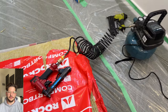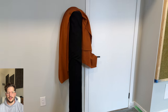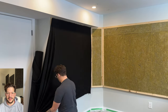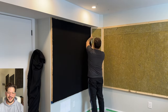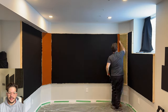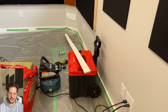Here is the stapler I'm using to staple the upholstery to the wooden frame — I'm using quarter-inch staples. The client wanted to go with an orange and black color scheme for this front wall. The large sections are all black, using a really nice heavyweight wool fabric, and the 45 degree sections are going to be in burnt orange. It's a really cool color scheme actually based off of his dog. Just stapling these to the frame, we want to make sure that we tension the fabric from corner to corner so that it lays nice and flat without any wrinkles. You don't have to over tension, but the fabric should be nice and taut.